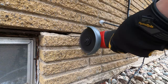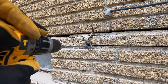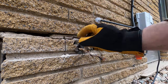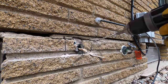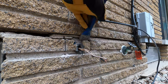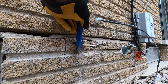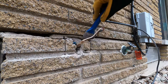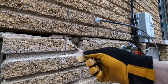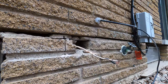I did start out with an angle grinder, and I don't think it's the best method — I've actually never done it before. I did it for this video because I hadn't owned one previously and wanted to give it a shot. Typically I just drill some relief holes with my hammer drill and then use a chisel. The brick and mortar used on everyone's home is unique, so either go with a tried and true method you know of, or if you see a different method than what I'm using here, go that route. Back to my method of the relief holes and the chisel — I do a line of relief holes around the border and then chisel it all out. Because I have the angle grinder cuts here, I just did the corners and then went to work with a hammer and chisel. Considering most homeowners probably own a drill and a pack of chisels is really cheap and easy to come by, this is a really inexpensive way to get a hole in the side of your brick house.